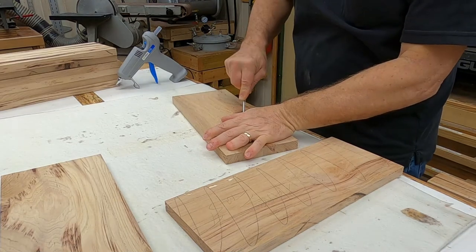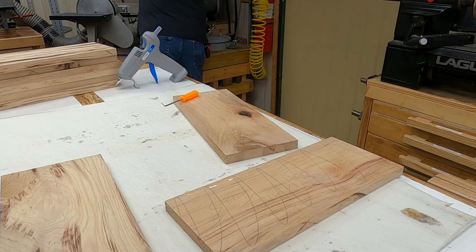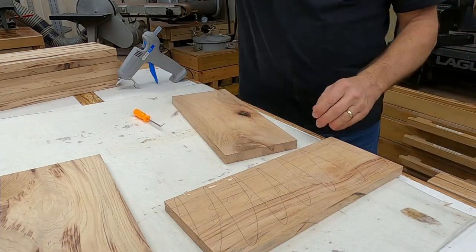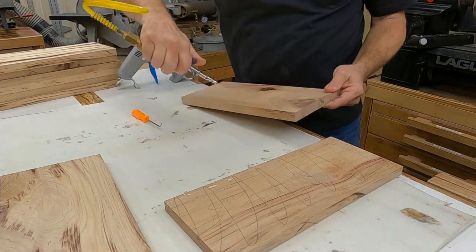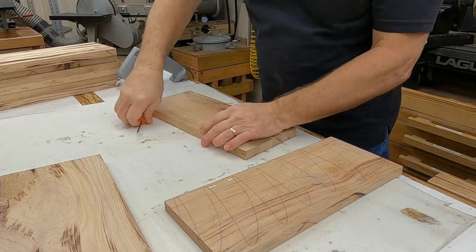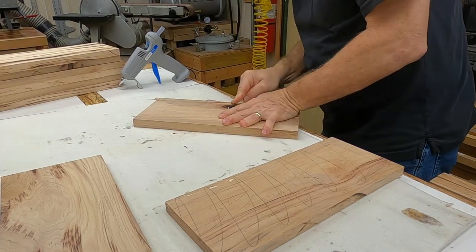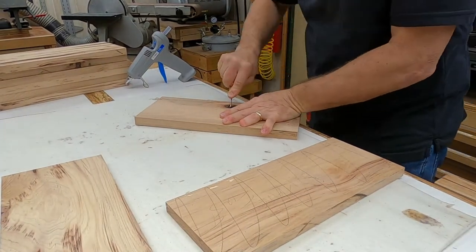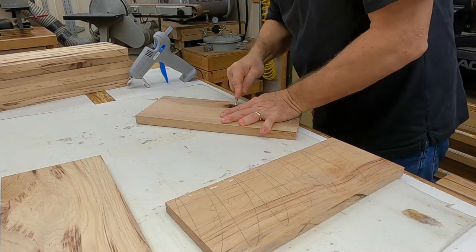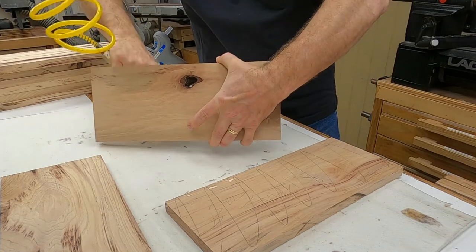As you've noticed, some of this wood that I'm working with here has knots and some cracks and different imperfections. But one of the things that is so cool today is we have resin that we can utilize in some of our woodworking projects. And right here, what you're seeing is I'm taking a few tools, some brushes and some scrapers, and I'm going through each piece of wood that I have, and where there is some loose debris, I'm just scraping those out, getting them ready for the resin pour.